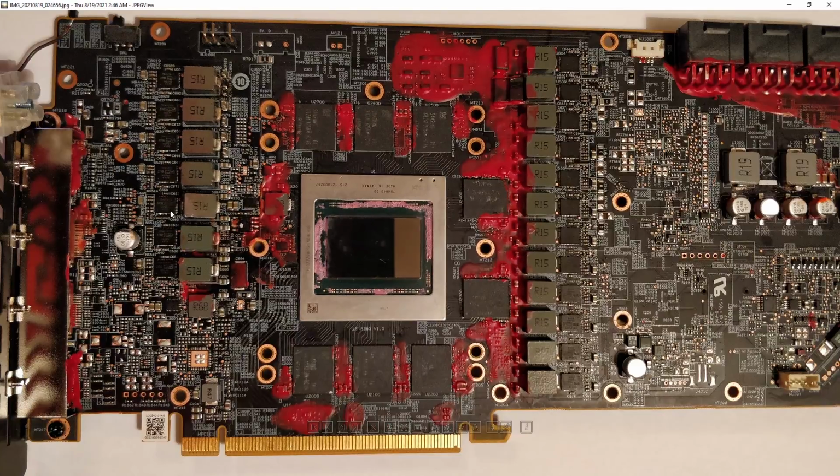But yeah, so even with that power stage disconnected, there was still a short circuit, and it's like, okay, so is the core shorted? Because generally, if you still have a short circuit and it's not a capacitor or a power stage, then it's the core, because there's not that many things connected to the vCore power rail most of the time.